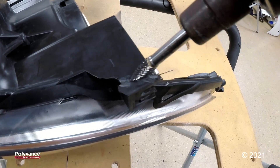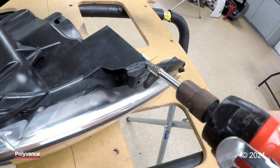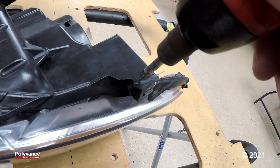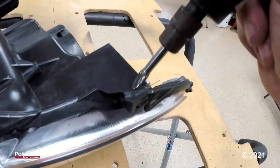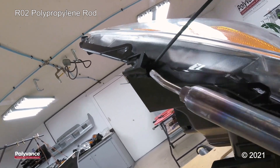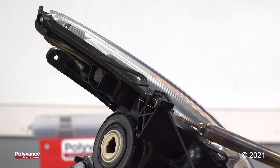What I've done here is I've v-grooved deep enough into the plastic so that when I start melting it's going to melt down to the tape and essentially weld the front and back at the same time, so that all I'll have to do on the back side is smooth with the airless welder.